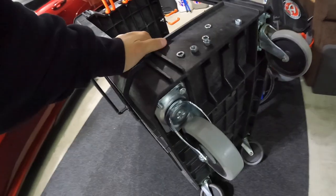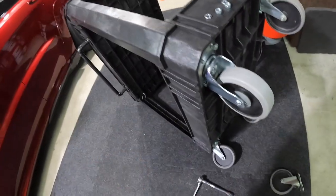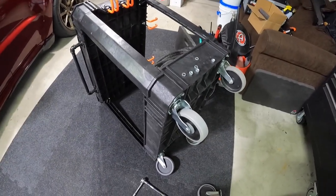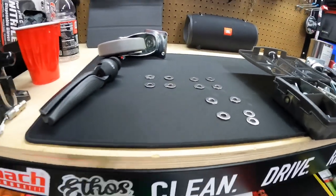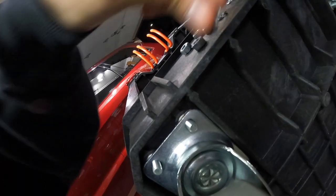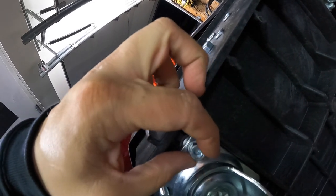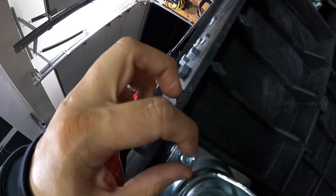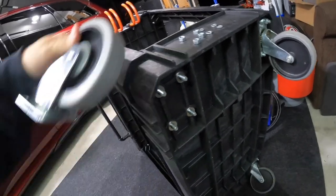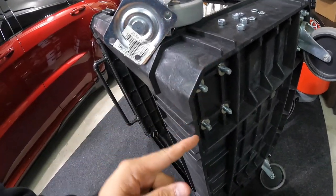It's going to hit — I'm going to have to put a spacer. I found a bunch of washers. I'm going to try putting two on each peg. My only real concern is the lock washer and nut. Actually, I'm going to do three washers so that when it swivels it's going to clear.